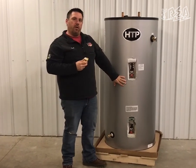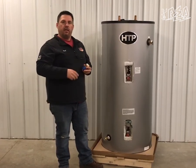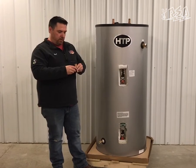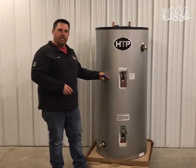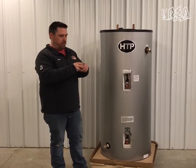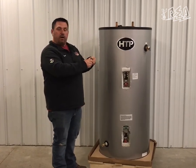The reason we keep the water heater at 150 degrees is because this water heater is on storage control — it only runs from midnight till 6 in the morning, then it's off all day. The water in the tank stays warm all day, and when the water is hot we can mix it using this mixing valve to get more hot water than the tank capacity. The tank is 100-gallon capacity, but we can get about 130 gallons of hot water out of it using this mixing valve.